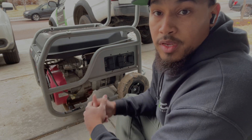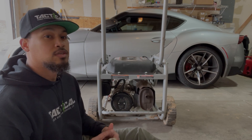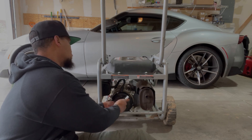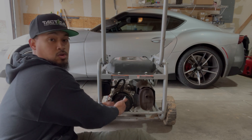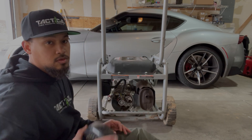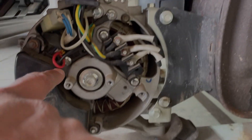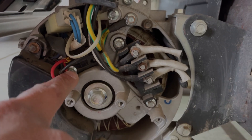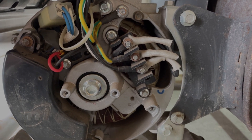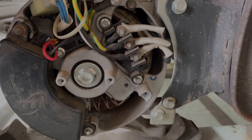The next step is to check your carbon brushes. The carbon brushes are located behind the alternator cover. This black box right here is your voltage regulator. You follow the red and black wires and they go to your brushes. That assembly has two carbon brushes that ride on your slip rings — that's how they make continuity for electricity to go through for the generator to create voltage.